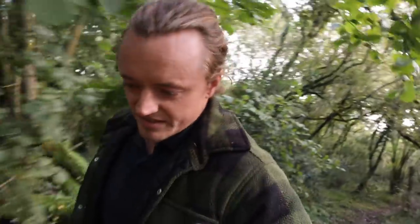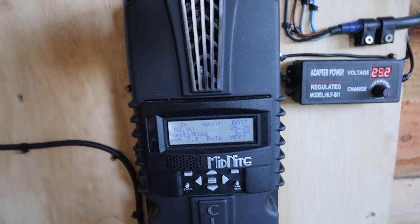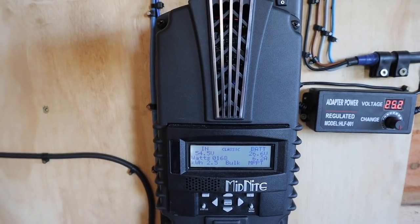I think people who enjoy the hydro videos will find this quite interesting. Those slots me and John put in were 5mm in each direction, and I think you'll be surprised how much difference it makes. We go back to the shed now and I'll show you what it's making at the top of its travel. It should be somewhere in the middle where it's about right, but let's see what the numbers say. We're reading 174 watts at the very top of its travel.